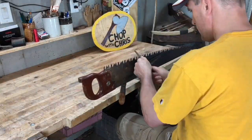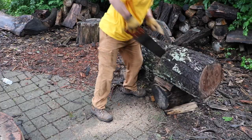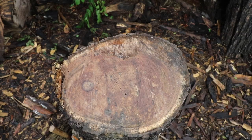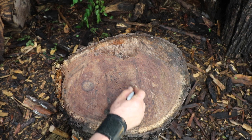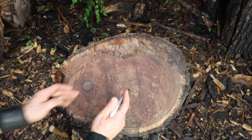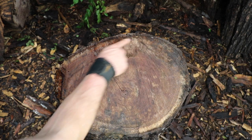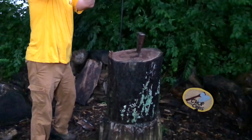The first tool I'm using is a cross-cut saw. You can see here is the pith — that's the center of the log where all the growth rings grew out from. You want to stay away from the pith because you get a lot of cracking in there. This is where it was splitting off, and here's a second pith, so we want to stay away from these. I'm going to split it to use this high-curve part of the tree. In terms of safety equipment, I'll be wearing wrist straps, leather gloves, and safety glasses.